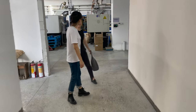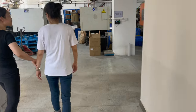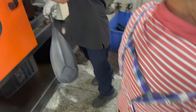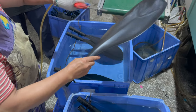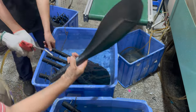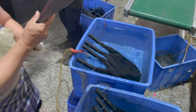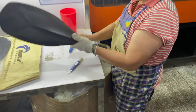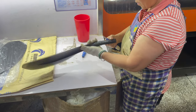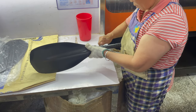These bags are pellets of nylon material. On the left there's Jenny, one of the factory owners, and these are the molding machines. This is thermal injection molded parts. We have an exclusive mold for our paddle blade that we designed specifically for this molding process. We designed it with a thicker spine on the back of the paddle to make it more rigid. A lot of plastic paddles have a lot of flex, but our paddle blade is quite rigid and performs really well.